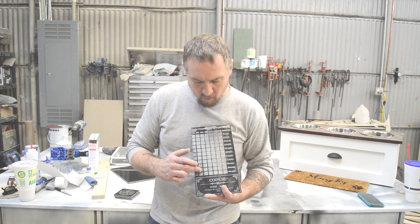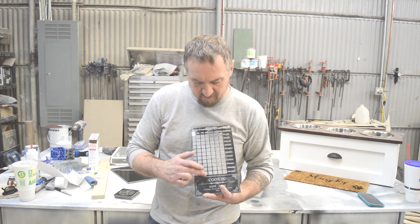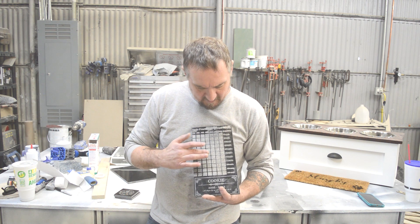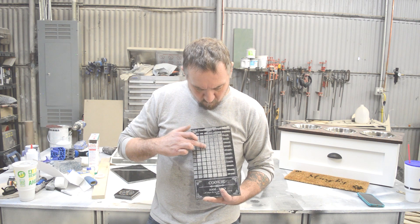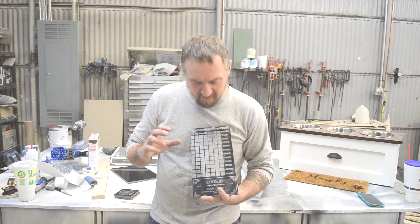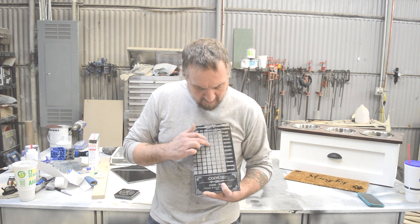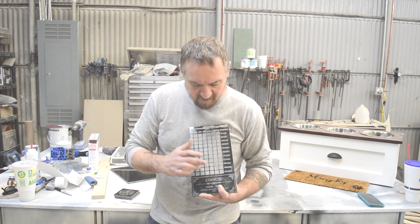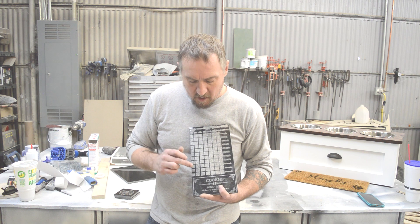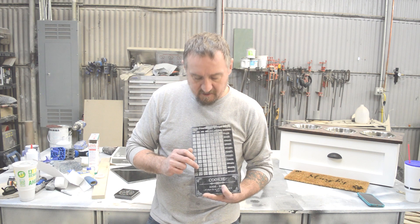You could go maybe a little more powerful — 30 percent at 300 millimeters per second — but once you start slowing down and getting higher power, it really starts to blow out the edges of your cut. I think that has to do with the crystalline structure inside the granite refracting the laser, because your crisp lines really start to fade away as you go up in power or down in speed. So what I used was 130 watts, 275 millimeters per second, and 20 percent power.